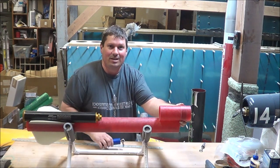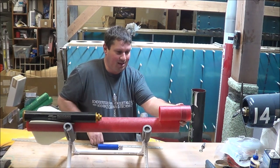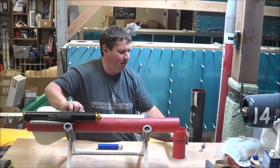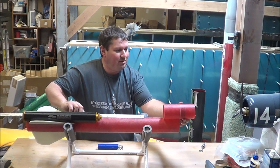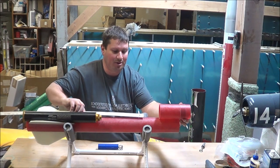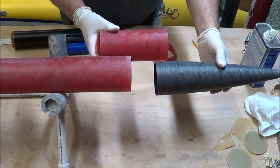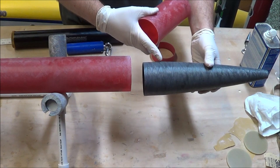Now this vent band is set up with all of the shoulder going into the nose cone. What I'd love to do is decrease the amount of shoulder going into the nose cone to make more room for the parachute. If I halve my measurement, that's half as much shoulder. I'd like to visualize if my GPS will still fit — and it looks like it will. However, the Punisher is designed to fit up to a 54-2800 case, which is 9 inches longer than the 1706 case. With a 9-inch longer case, there's no room for the GPS even with the vent band set to go all the way into the nose cone. So in my opinion, it doesn't really matter if the avionics bay goes all the way into the nose cone or a couple more inches into the booster tube — the plan is to have it go a couple more inches into the booster tube.